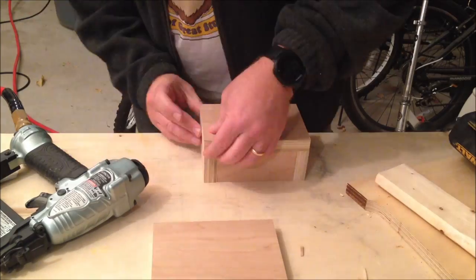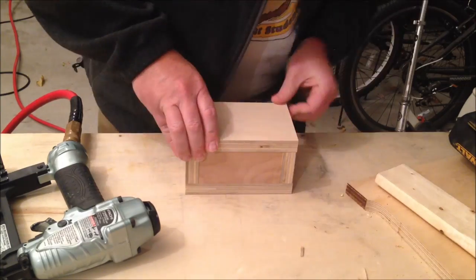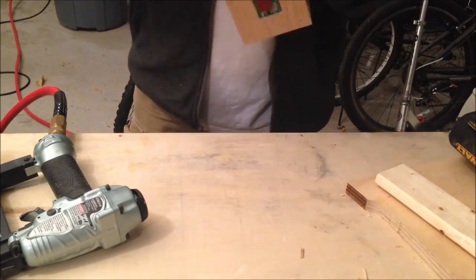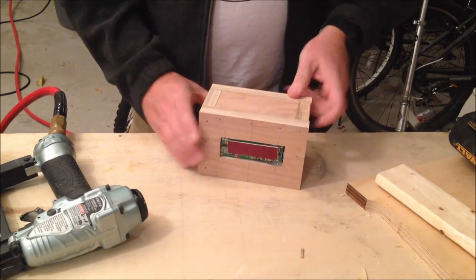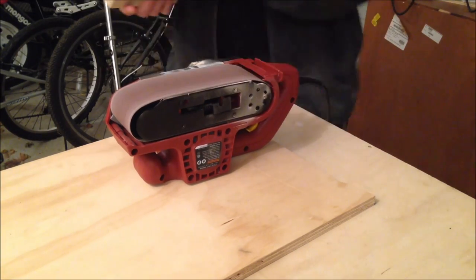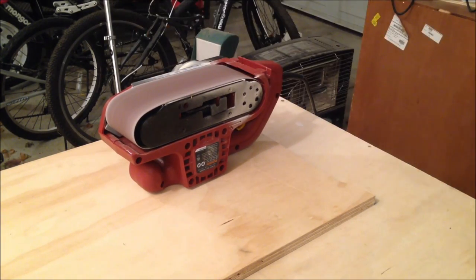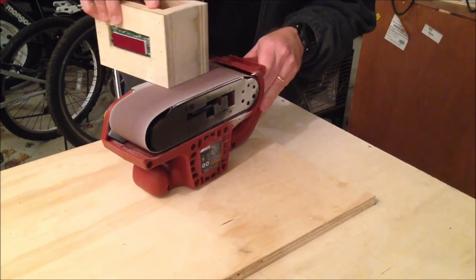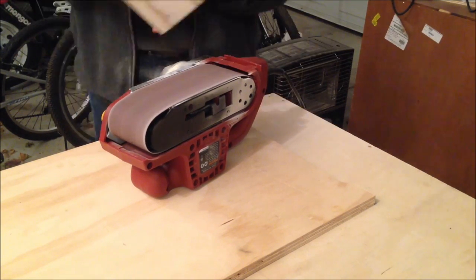When it's sitting on your desk, you don't notice it anyway. Even though I was really careful, the pieces still didn't line up perfectly, so I went to the belt sander and sanded everything smooth. That way there wouldn't be any bumps or anything in the veneer once I attached it. This worked really well — just turned the belt sander upside down and ran it over the top. All the sides ended up really, really smooth to each other.